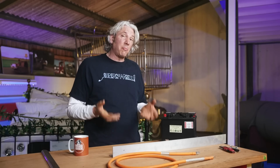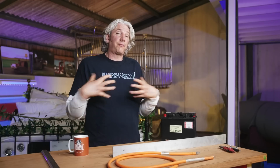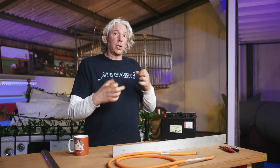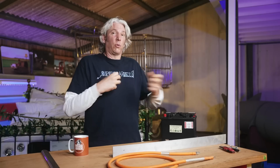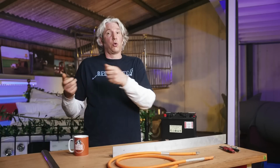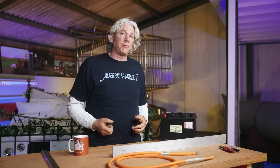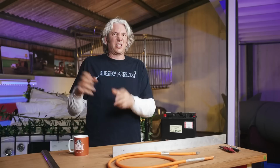And when we start talking about even bigger currents, things get really grisly. So at 100 milliamps, your heart starts to fibrillate, which means the muscles are no longer pumping all as one. They're all over the place, which means, of course, your blood stops going around your body. And at 200 milliamps, your entire chest clamps right up, and basically everything stops working. But weirdly, at that level, if you can be pulled off your electrocution source quickly enough, then you might actually be able to be revived. But of course, if you're left there too long, things start to get cooking, and it's very, very unpleasant indeed.